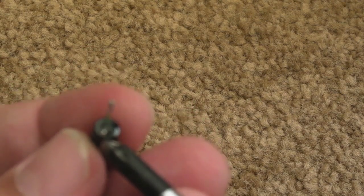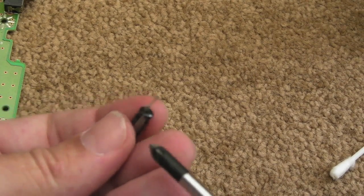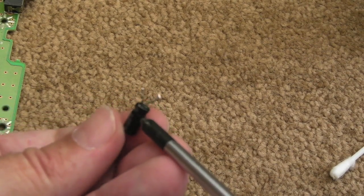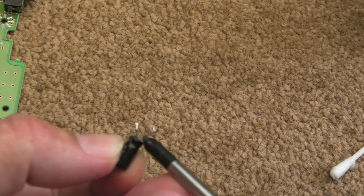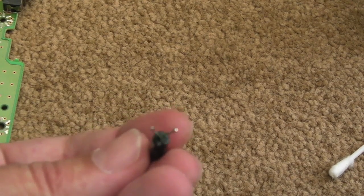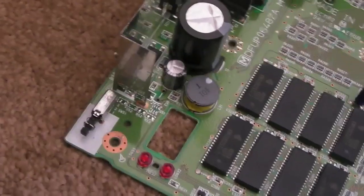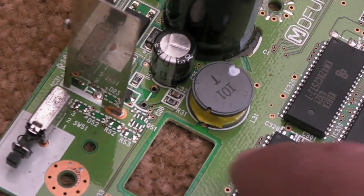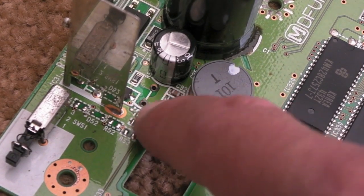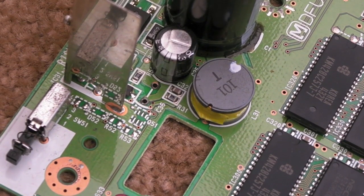You can't quite see it, but basically there's loads of mucky, mulchy sort of stuff here — looks like electrolyte or something that's leaked out. The pin's green, there's blacky mucky stuff underneath — it's bizarre, like it's melted perhaps. On the board you can see, where I've cleaned it up, that pad is looking a bit corroded. It was much like that with that green stuff. So I think that cap might be the issue — I'll swap it out and give it a try.